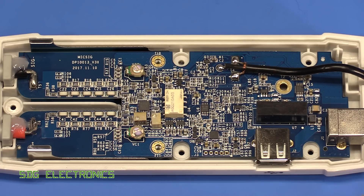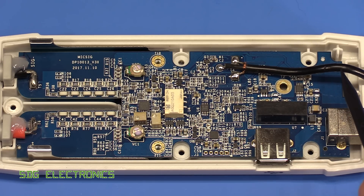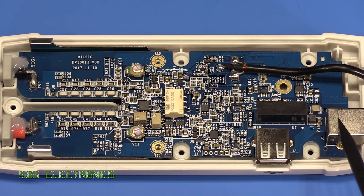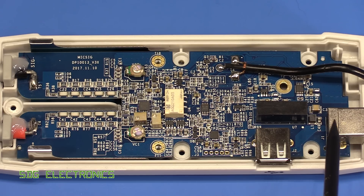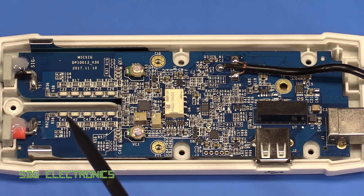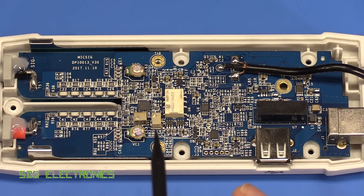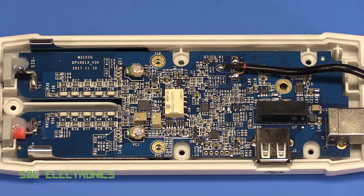It then switches between a couple of gain resistors on this op-amp and buffers that output to your oscilloscope. The DC-to-DC converter is basically eliminating a ground loop between the BNC connector to your op-amp and the USB connector — if this is connected to a PC or another USB supply you could have a big ground loop between your oscilloscope and this USB lead, which could really interfere with your readings. Overall the construction looks really good: there are a couple of trimmer capacitors here, presumably for input compensation, but these are preset so I'm not going to fiddle with those. There is also a shield on top to shield the high-impedance section, and then the front cover just clips on.